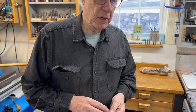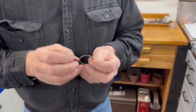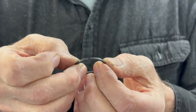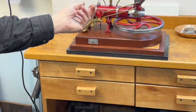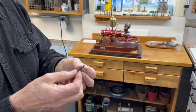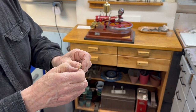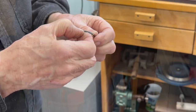When you see the dimensions of a piston ring for a piston, it isn't really that important. One thing to remember is the width and the thickness should be approximately the same, and you have to spring it over the piston. I looked at the plans for one engine and thought there was no possible way to get the ring on the piston — but I tried. I made the piston rings and they were perfect, but they wouldn't spring out big enough to fit on the piston without breaking. I broke one, so I went down to a smaller piston ring and it worked perfectly.